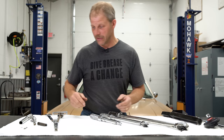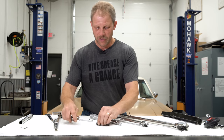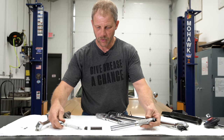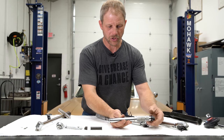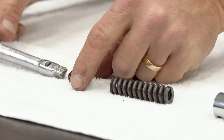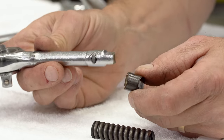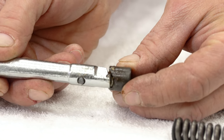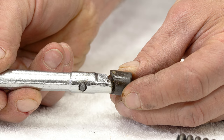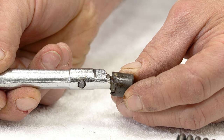To explain how that works in more detail, I took a wrench apart to show you the functional apparatus. Here's your handle — this is your wrench. The working mechanism is: as you adjust the handle inward, what you're truly doing is compressing this spring, putting more load onto the bottom of this little puck here, which goes right up against the end of the wrench. The wrench actually pivots out here at my fingers. As you add more torque, you finally get to the point where it breaks over. When your torque increases and you exceed the load of the spring, that gives you this over-center function — it will click audibly, and you also get feedback through the handle that you've reached your torque.